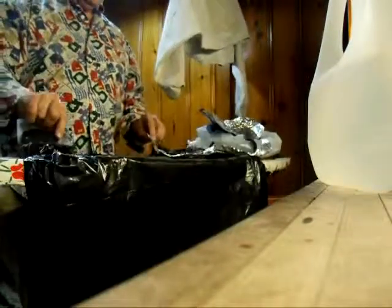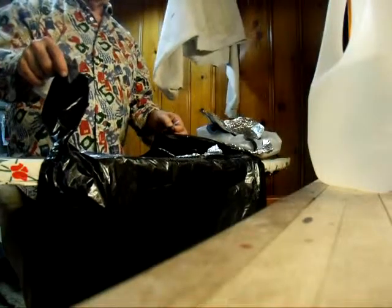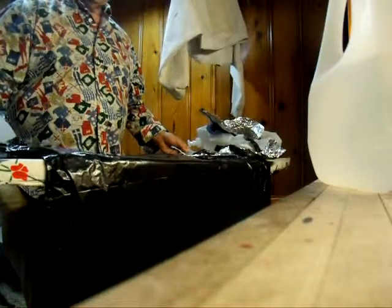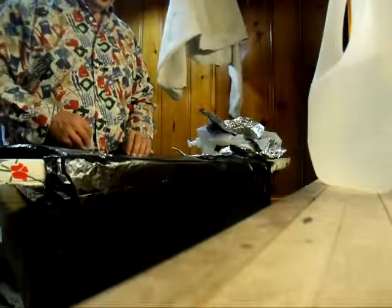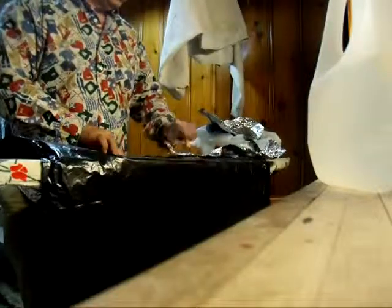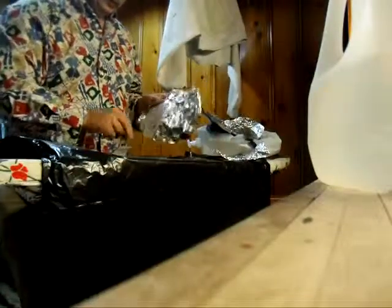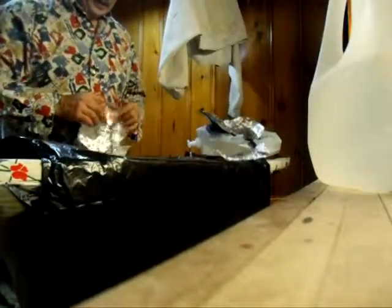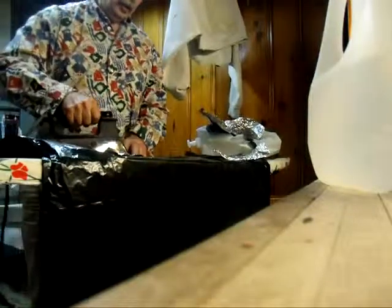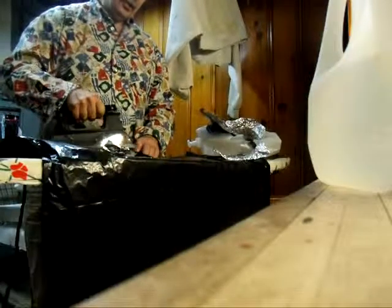I did some over here — these are fixing points where I can punch holes and put ropes or strings in to hold this particular thing, which will eventually be an inflatable hot air collector. So what you can do is lay this thing down and then use the iron to heat seal this high density polyethylene to the low density.